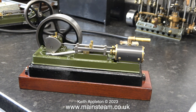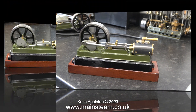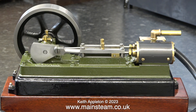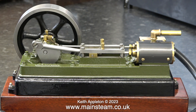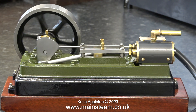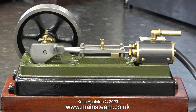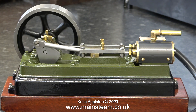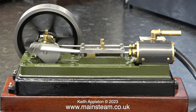This engine had been used to drive a generator and when I bought it, it was worn out. A Stuart S50 has the bearing blocks cast into the bed plate and these have always been okay. They wear quite well, but this one had done a lot of running and in my opinion the original design of the bearings needs an upgrade to carry such a heavy flywheel. If you've been following the series you will realise that I modified the bearings and the modification was quick and successful.